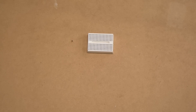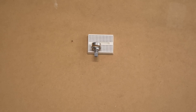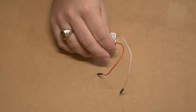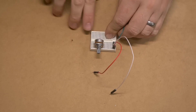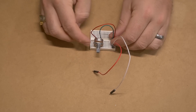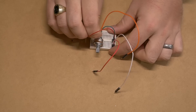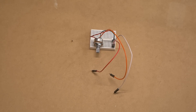We're going to start off by making the controller with the rotary potentiometer. Attach the rotary potentiometer to the breadboard. On this side at the edge we're going to use that as our power strip. We'll start off by hooking up red for our hot wire and white for our ground wire. Then we're going to take the ground side and connect it to the right side connector of the potentiometer. The potentiometer has three pins: one for hot, one for ground, and one for sensor output. We'll connect the hot line to the far left side, and take this orange wire and connect it to the center pin, which is the sensor pin that will go into our Arduino. That's all the wiring we need to do for the potentiometer.